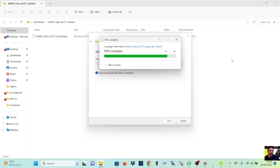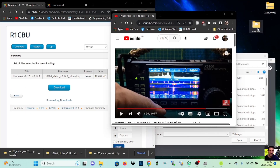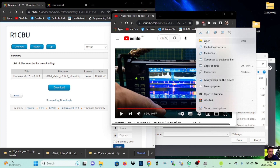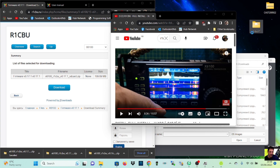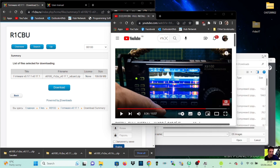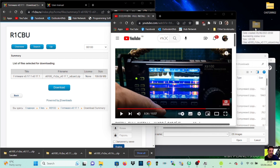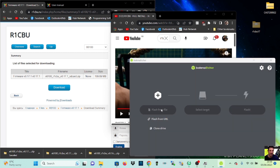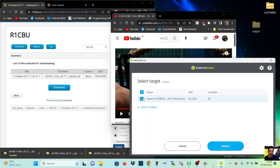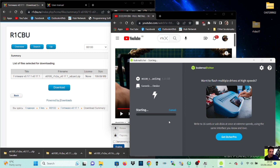That's done. Now let's close that down. Right-click, new folder, show more options — it's a bit laggy today. Select new folder, and we've called it r1cbu 17. Now let's go to Balena — close this down, flash from file, go to that file, double-click and there it is. Select target, which is my SD card plugged into the laptop, select, and then flash.